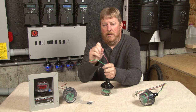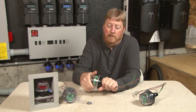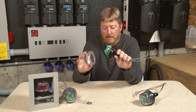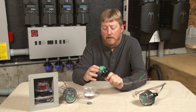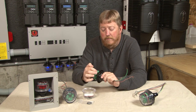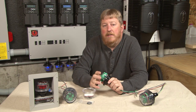In a surge, it comes in on the red, it clamps it to a safe voltage, and it shunts it to ground. The SPD also has a NEMA 4X case — it will come sealed from the factory. NEMA 4X is rated for outside, which sets us apart from a lot of the competition. Your visual indication of readiness — the bright blue LEDs — can be seen.